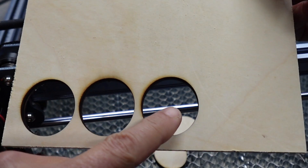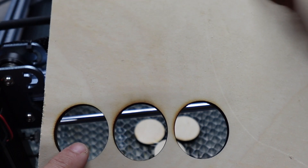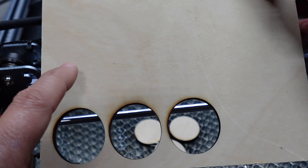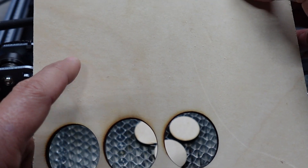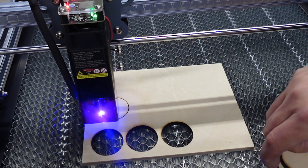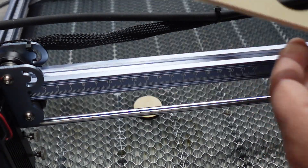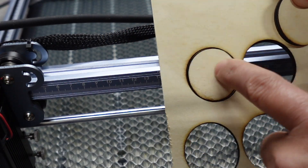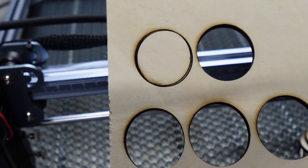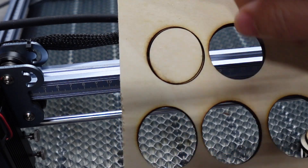Check that out — these two were overkill. I did three passes at 10 millimeters per minute at 100% power, and nine passes too. Let's refine it: I want to try three, four, and five passes. Unfortunately I bumped the piece so that didn't work. Five passes cut through cleanly. Let's try four passes — so it's either four or five passes to cut all the way through 6mm basswood. And it basically cut through in four passes.